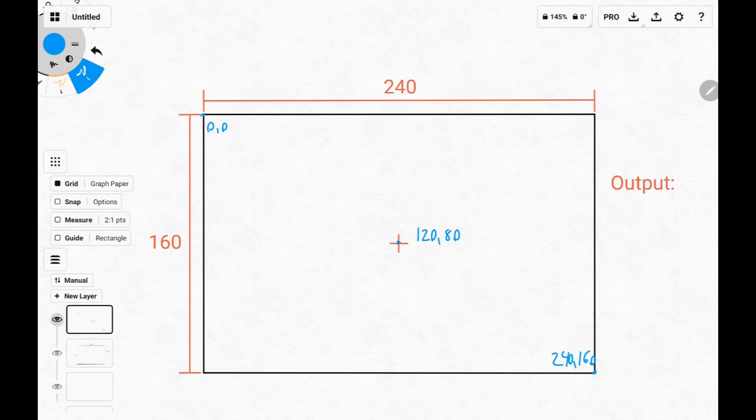For each loop of the program, a still frame from the camera is evaluated and the program will output an XY coordinate to the Arduino. When there is no face in frame, the program outputs 0,0. When a face enters the frame, a rectangle is drawn around it and the center point of that rectangle is calculated — in this case it would be 43, 112. This loop of capturing a still, searching for a face, and outputting coordinates happens at a rate of about 15 times per second.